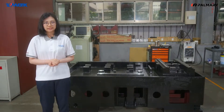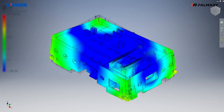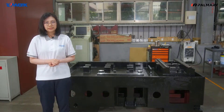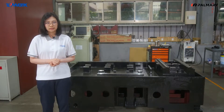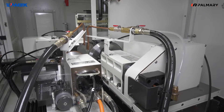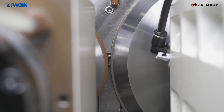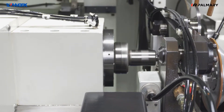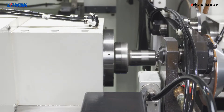The bed of the grinding machine is designed as a box-type structure. We use several testing and analysis systems, such as CAE analysis, to obtain a high rigid structure. We use BT40 as our working head spindle taper. It can be equipped with different clamping systems by installing bolts or rods. The grinding method adopts a double spindle design, where roughing and finish grinding operate together. The spindle head with high-precision P4 grade ball bearings can bring high stability.